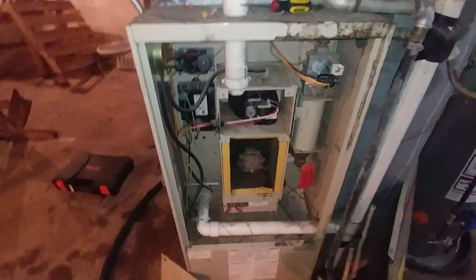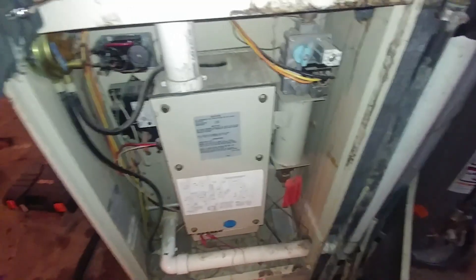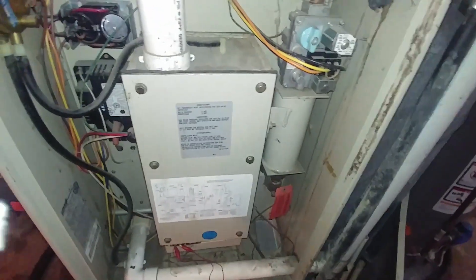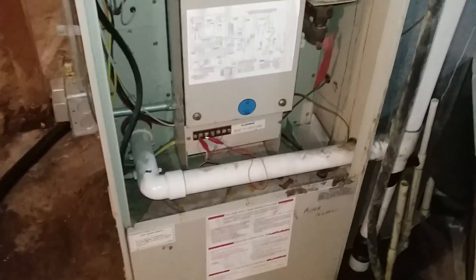1987. Very old, very efficient, very noisy furnace. Anyway, I've got to put it back together, but it's working now, so I'm happy. I had to replace this pre-purge motor. Last thing worth mentioning is listen to how loud it is now that everything's put back together. You can just barely hear it — it's amazing. Most of the noise actually comes from this buffer tube when the system is running.